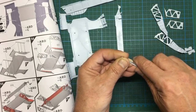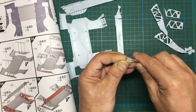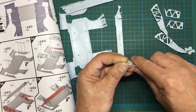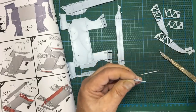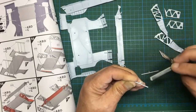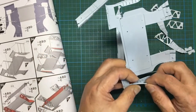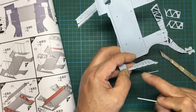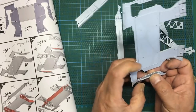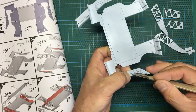These triangular bits need some trimming. You need to take a knife and cut down the back, taking about half a millimeter away from the back of the triangular section, and sand a little from the bottom too. Then it'll fit in there. You also need to make sure it sits in these radii properly - not sitting too high.